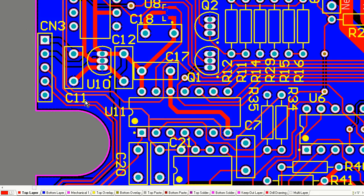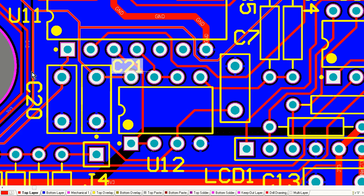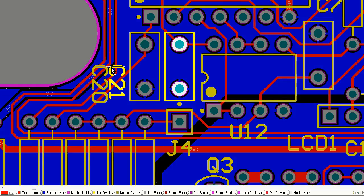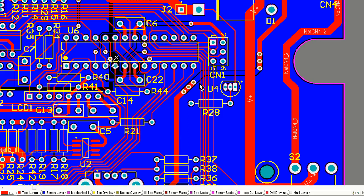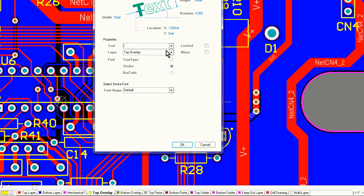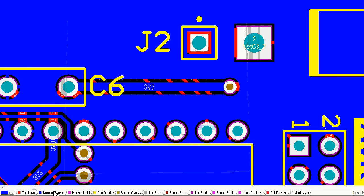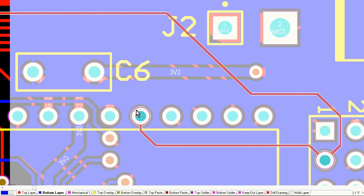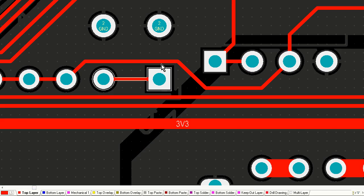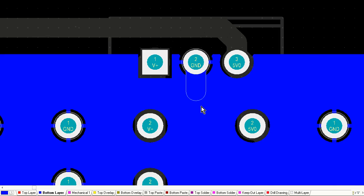And now I'm going through and just shuffling all of the component designators. There you go. I'm moving them around, rotating them, and putting them next to the particular component, making sure they don't overlap any of the pads, because you don't want the silkscreen overlapping any of your pads. That can affect you. Generally it doesn't affect your soldering, but it's just not good. And you want your silkscreen designators all the right orientation, all the right size, so it all looks neat and professional. I'm going to add some labeling. There we go, AVR ISP. I added a label right next to the connector, and I did it as an inverse.